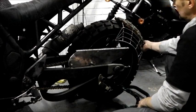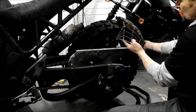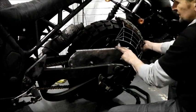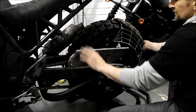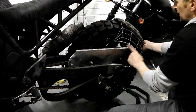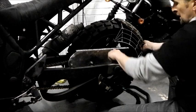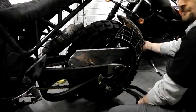The beauty of that is now I've got the ability to bring rods along, side by side, weld down between them, and then just come over, pick up the shapes, and that will stiffen that up more. That's beef now, ain't going anywhere. The mount points are very strong. This end, the back moves a bit, but it won't move so much once this is welded on. If it does, then I might just take a drill through the billet here, or perhaps drill down into the billet with a little L bracket there just to hold it. But either way, there we are.